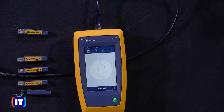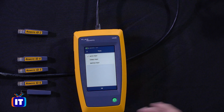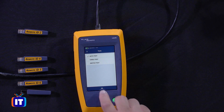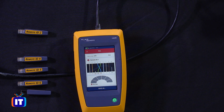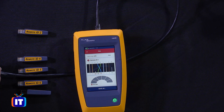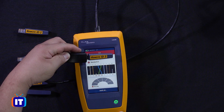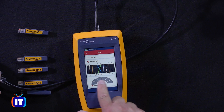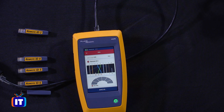If I go back to the home screen, the auto-test does two things for us: we can do an individual cable test or a switch test. Auto just detects and selects automatically. I'll simply hit auto-test — and look at that, there is a failure on this particular cable. I can verify by the background, and there it is: remote ID3. I can see there are some different issues, and down here you can even see the wire mapping, which absolutely shows something is wrong and marks out the individual cables where something is going on.